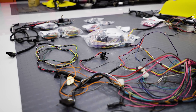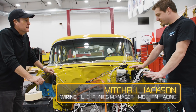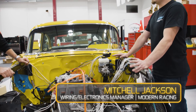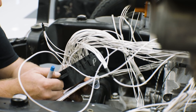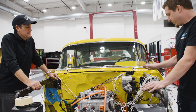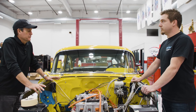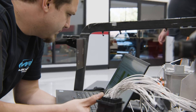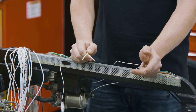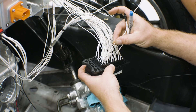We're here with Mitchell from Modern Racing. They came over to lend a hand with the wiring. It looks like a nightmare to people who don't wire, but the way wiring normally goes is it looks awful until right to the last 5% of it. We've got the fuse boxes and the relays done right now, and we're getting ready to go into one of the control modules. Then we'll start tidying it all up. While everybody sees a mass of white wires — hard to find colored wires these days — all these wires have little numbers, circuit identifiers on the end, so you can look at the blueprint and know where each wire is supposed to go. Colorblind people can work on it just as easily.